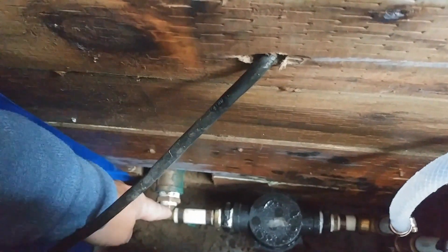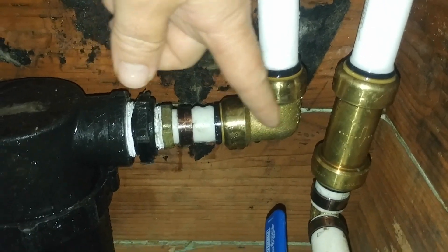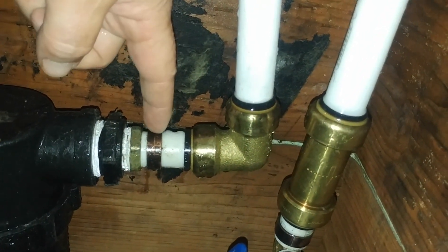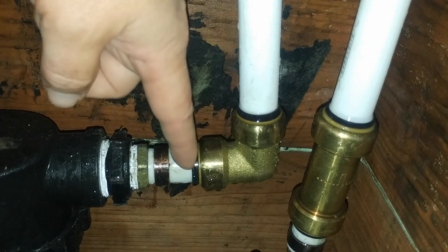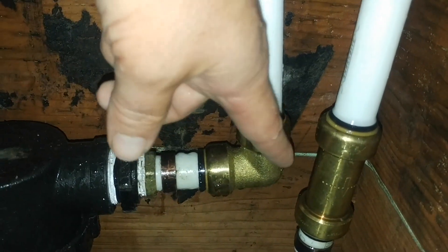This is the pipe from the cistern. It's pulling in from the foot valve in that black pipe and it goes to a filter here. That filter is unscrewable — I can unscrew it, drop it, and take the wire mesh filter out and clean it. The output of the filter goes up to a SharkBite fitting. I used that SharkBite fitting because it was so close I couldn't use my regular crimping tool. A lot of people like these but they are very expensive; however, if you're in a tight situation, consider getting one.